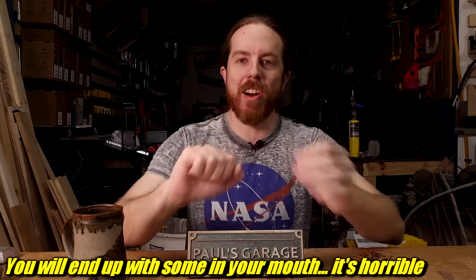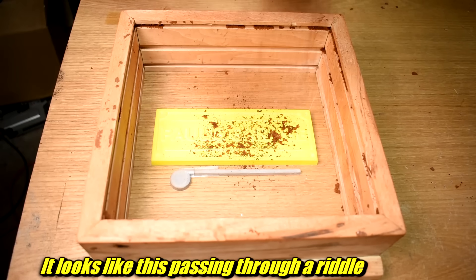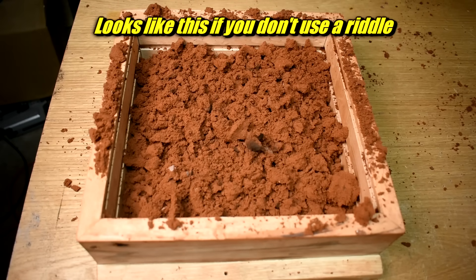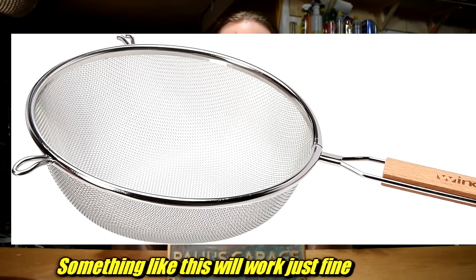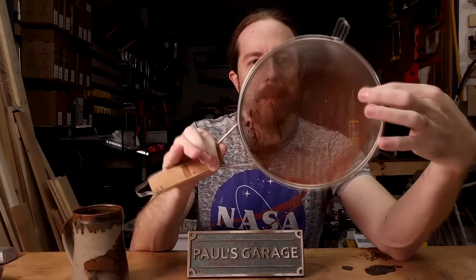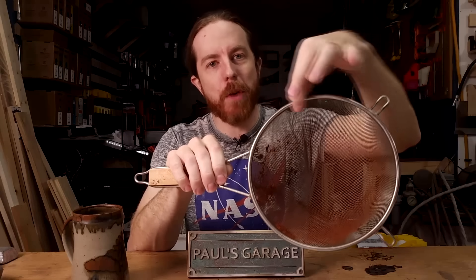If you're just going to get started, just buy a bag of Petrobond. A tip for handling Petrobond: I wear nitrile gloves now. That stuff will stick to your skin like crazy and it's hard to get off. It'll also stick to itself, which means you can't lay it down evenly — you'll pick up a big block. So you need something called a riddle. A riddle is a tool that you pass the sand through to break up the clumps, especially when putting the first layer of sand down. It's not a special fancy tool. Here's mine — it looks like a 16-mesh sieve. With Petrobond you have to push it through rather than shake it. You probably have one you can swipe from the kitchen. One tip: if you push too hard, you can pull the wire mesh out of the crimped rim and it will not go back in.